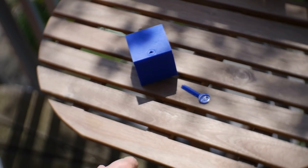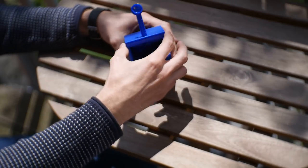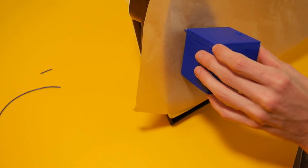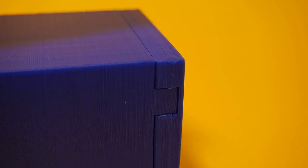Initially my brother and I designed this box to look as close to the one in the movie as possible. We decided to do this by printing the lid and the body separately. However once we had the two parts we had to fuse them together somehow and we didn't want any nasty seams or glue hanging out. So we decided to rivet them together with a piece of filament. For this we used a soldering iron and a piece of baking paper. We took a piece of filament, put the baking paper on one side and the iron on the other and heated up the filament so we got a nice rivet-style plateau. Afterwards we repeated it on the other side and got a nice flush, completely inseparable assembly.